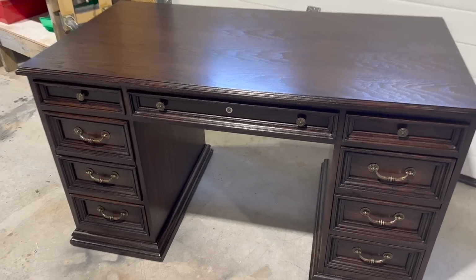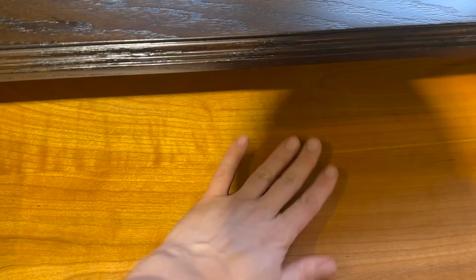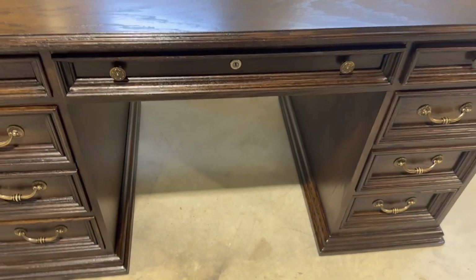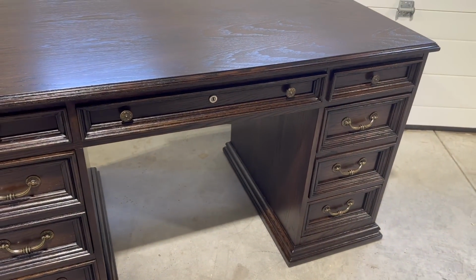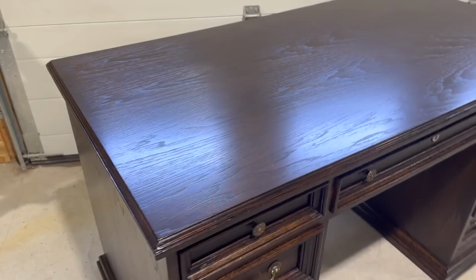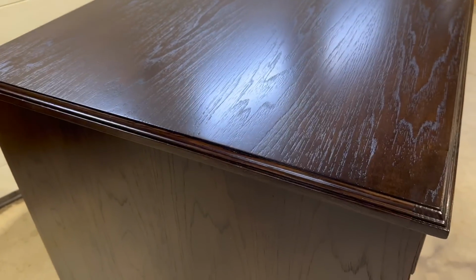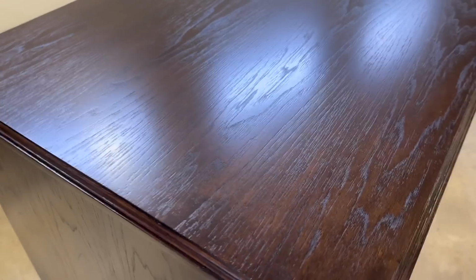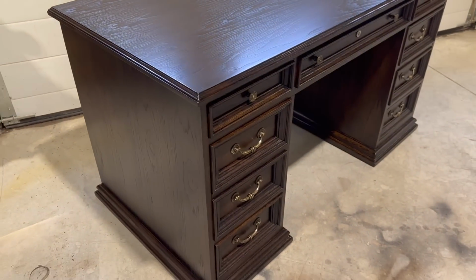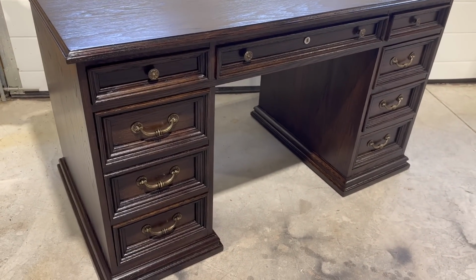And I did refinish all the interior of the drawers as well. So those are all nice and clean and smooth. A couple of drawer stops we had to replace. A lot of interior damage. Bunch of repair on the veneer, on the top. And all those little scratches that were part of the old finish, we had to sand those all out. But anyways, I think we ended up with a pretty good finish here, and